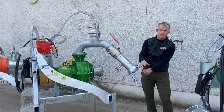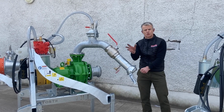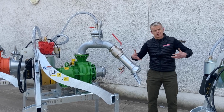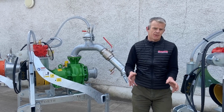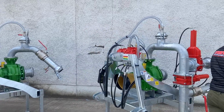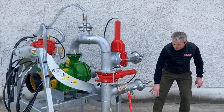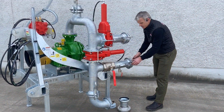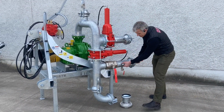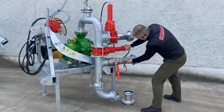Now that's okay if our pipe's running downhill. If our pipe's running uphill, we have an opportunity to get covered in slurry, and you're trying not to do that. So basically what the sponge chamber offers us is an opportunity not to split the field pipe, which is here, but to basically feed a sponge in, and I've got one in here already prepared. Just pop that off.